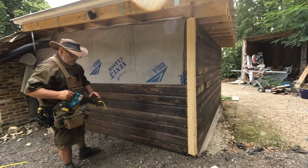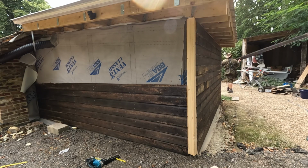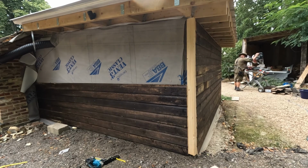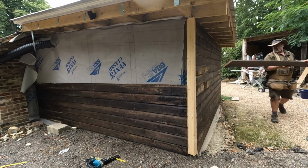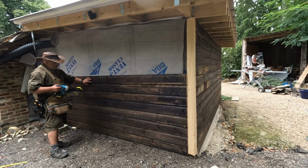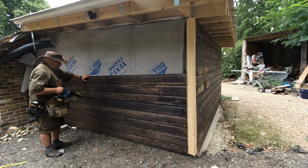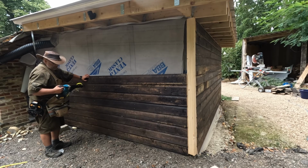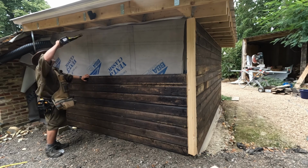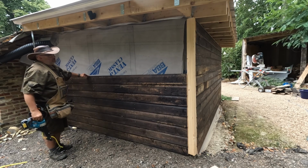But when it works well, it saves you a lot of time. It's nice that it's got a variable depth stop so that it doesn't push the screws in too far without you realising. So when it goes in well, I say this machine's brilliant. But when it jams or puts the screw out at a different angle because you're trying to do it at a weird angle up here, or you're trying to do it left-handed, it's not as good.